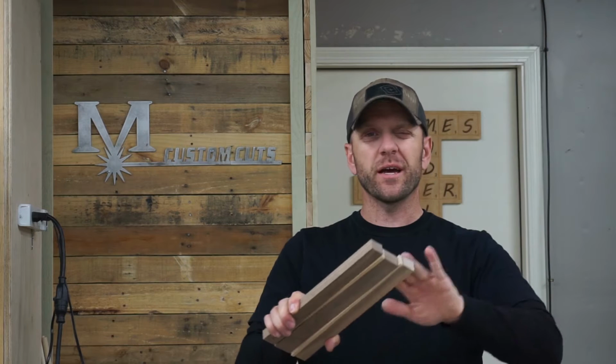And then once that's glued up, we're going to go ahead and sand. This is already kind of pre-sanded from the box stores. So I'm going to start with 100 grit, then work 120, 150, 180, 220. Probably stop at 220 because it's just a bottle opener. And then we'll throw a nice lacquer on there, make it nice and shiny.